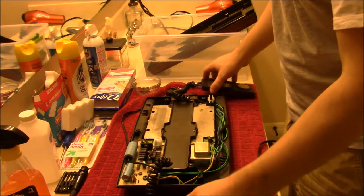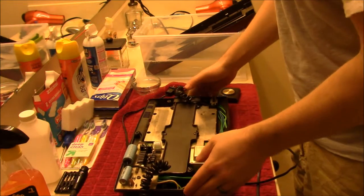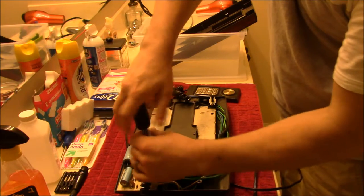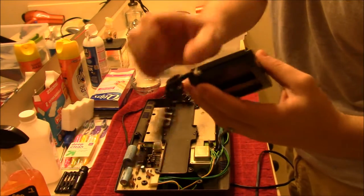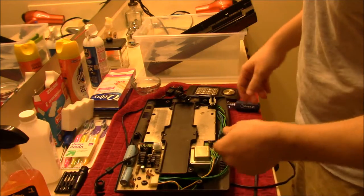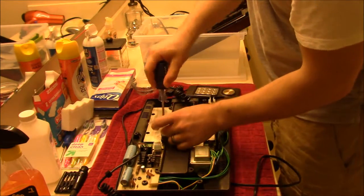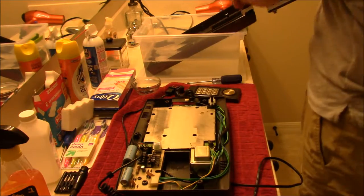You can see the actual controllers right here — they're all hardwired, everything's connected. First thing we're going to do is take off this plastic inlay, which is basically where the controllers rest when everything's put up. I can already see one of the problems — most likely why this thing doesn't work — the cord is kind of torn. That's a problem with these machines: if any part comes loose it's pretty much dead and you have to replace the whole thing. Not the best design ever.